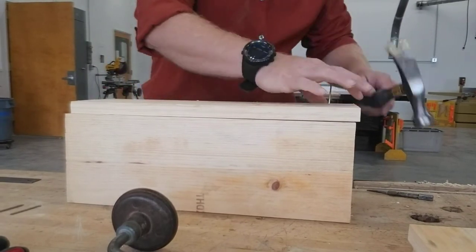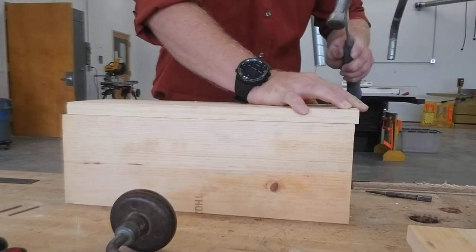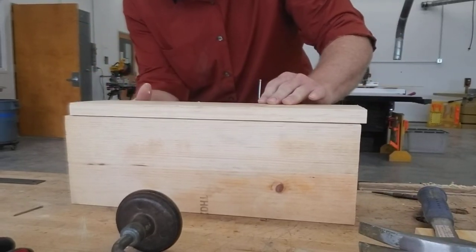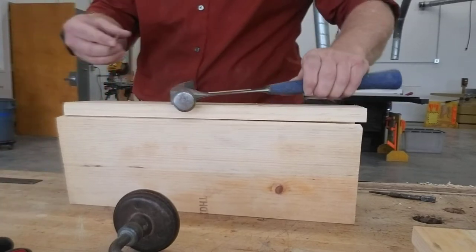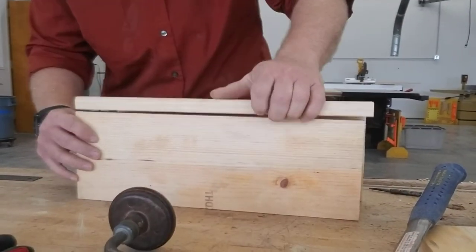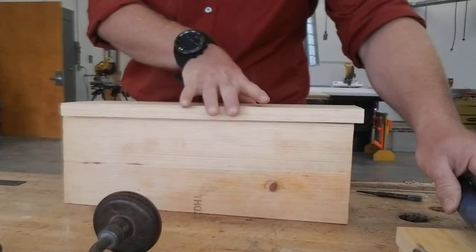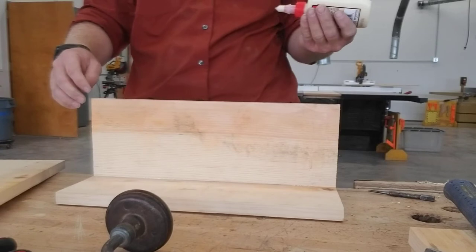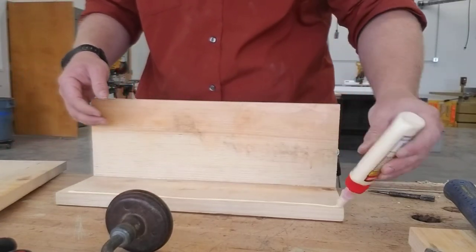Grab a nail. Hold it so that it's flush to the corner, the edge, and the bottom — just flat. We're going to do them one at a time as we go over. We don't want to do both ends first; we want to work the board over. If we have to, we can tweak it and get a little more control. So now that one's done. The glue is what's holding it in place long-term; the nail is what holds it in place before the glue dries. They're both holding it — the glue long-term, the nails short-term.